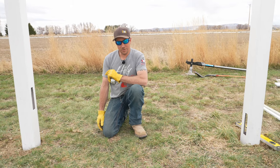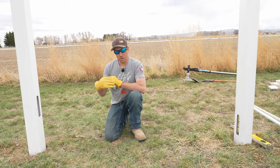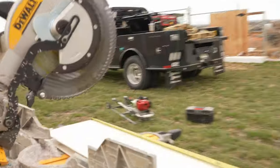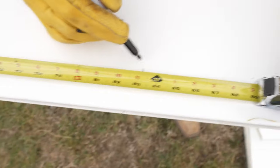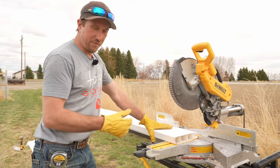If you're not using a no-dig system, you need to add three extra inches to the overall length — an inch and a half per side — and it's still highly recommended to cut that angle. On the very bottom we're going to mark 83 and a quarter, set it right on that line, put a mark, and draw and connect these lines to give us our angle on the other end.